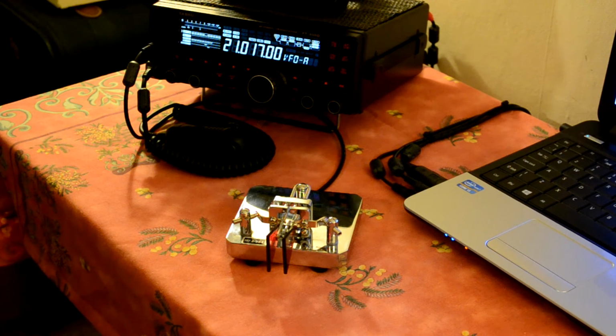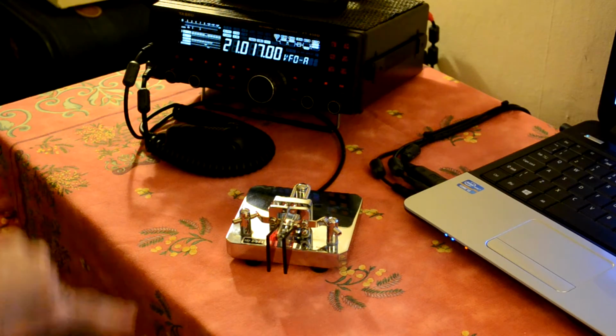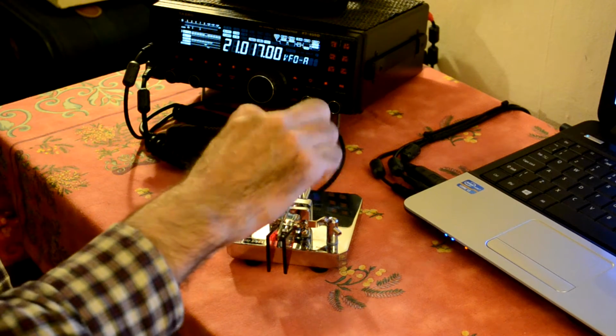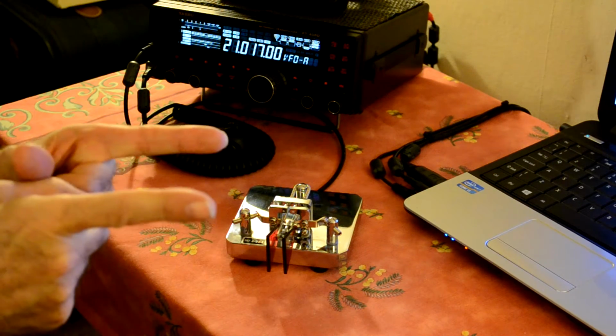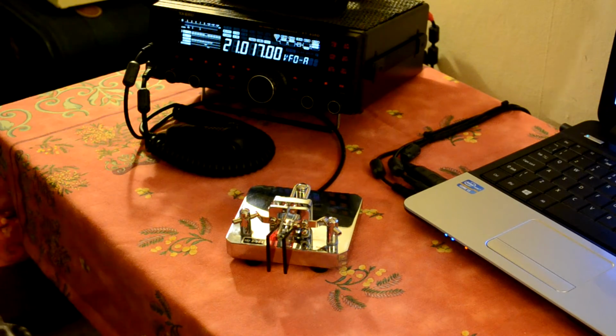I would say it was a Morse key kit. Every screw was loose, and there was no way they were going to stay where they were, because there was no form of any lock nuts, and what it was is that on this piece here there's some cone bearings. There's screws with 2 points on, and they were loose. It didn't matter what you did with them, they were just shaking in their threads, and there was no way of locking them.